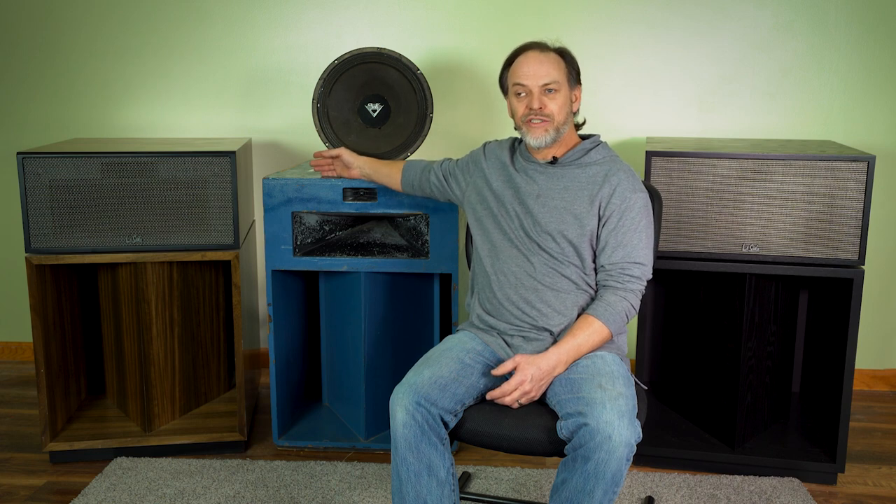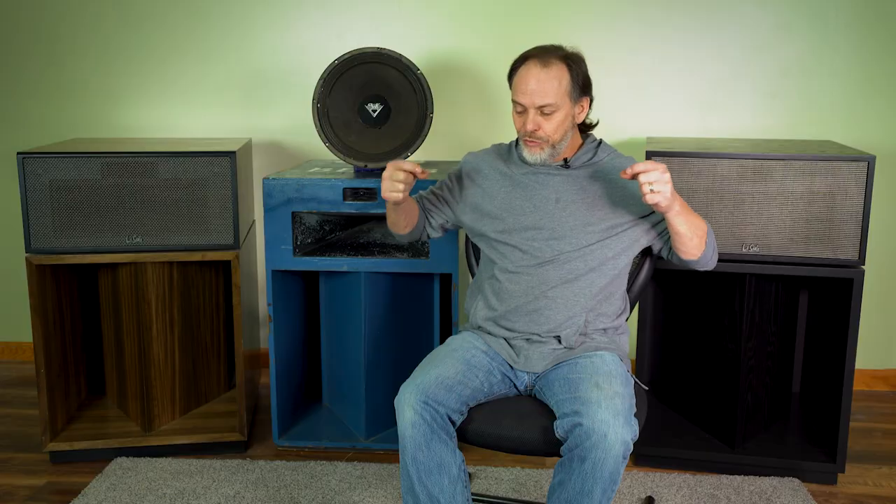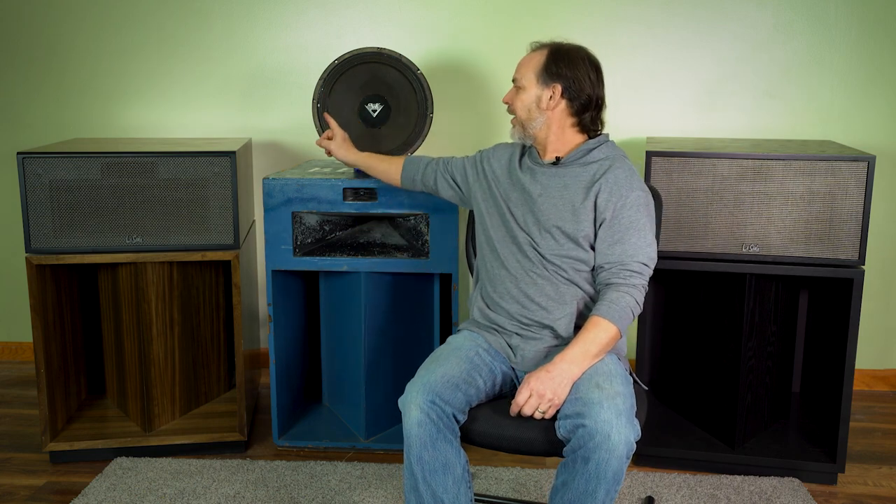This woofer, being a 1980 tone standard, was probably a driver change when they went into the pro world. In 1977, Klipsch started building the pro or industrial line products, including an industrial line La Scala. There was a change in the LF cabinet — the doghouse as they call it. In 1977, pro doghouses have a quarter-inch groove cut into the edge of the board at the very back so the basket can slide into that slot. The reason is the basket is wider by a quarter inch, so you either cut a slot or grind two parallel sides off the basket to make it fit.